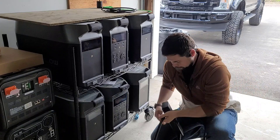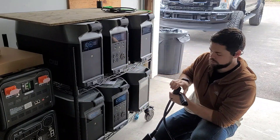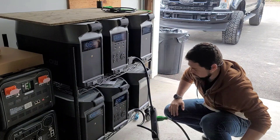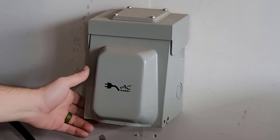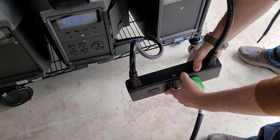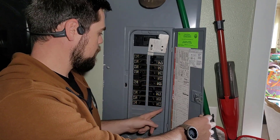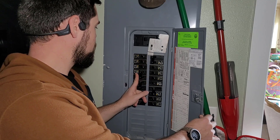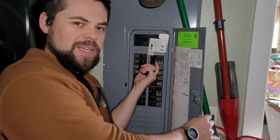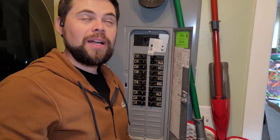I've got my cables here. Take my connection hub, turn on this unit and turn on this unit — I'm not turning on the AC power yet, just the displays. Making sure the clips are facing towards me. Clip that one in. Before I turn on the AC power, I want to plug this in — flip this up, the shiny middle part plug on the side, push it all the way in, then push the AC on/off button. Hear everything turn on. Back at the electrical panel, because I have 240 volt power I can power both sides of this. I'm going to start turning things on one by one — I feel like I'm in Jurassic Park switching back on all the switches. And just like that, we're now running the whole house again. You can see the lights turned back on.